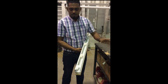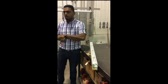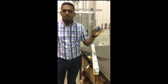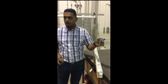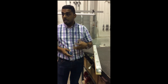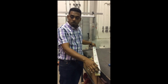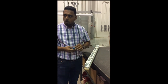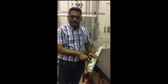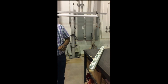The white motor is the standard motor — it lifts somewhere around 10 to 15 pounds. Anything wider or heavier than that, you should go with the blue motor, which is a lot stronger. If the fabric is room darkening, you lean towards the heavier motor because it's a heavier fabric, but in most cases you use the white motor. Some shades from outside fabricators use a brown motor or a gray motor. The gray and brown motors are the two lightest motors available. So between the white and the blue, there's a mid-range — you take the gray and add it to the white, giving you a mid-range tension instead of jumping straight to the blue. That gives you flexibility to play with the tension on the motor.